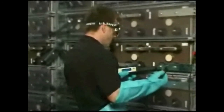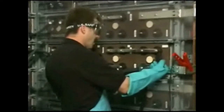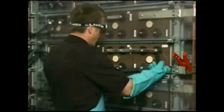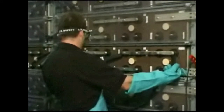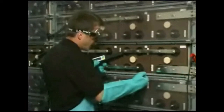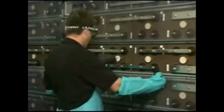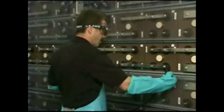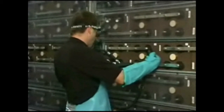I'm going to measure the internal impedance of the cells using the battery impedance test equipment. I'm going to measure diagonally across the cell with the receiver on the positive post and the potential probe on the negative. Then I'm going to measure the inter-cell connector all the way across, and then measure diagonally across the cell once again. It shows cell number two on the LCD. And then all the way across the inter-cell connector, which is called a strap. You can hear a beep when the measurement is written into memory.